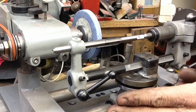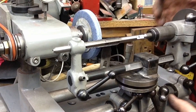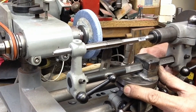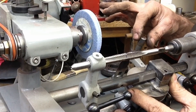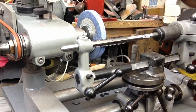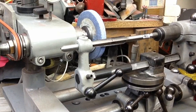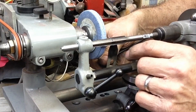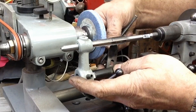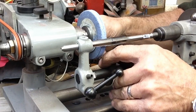To change flutes, you just rotate up to the next one and apply downward pressure to line up the flutes. You can set angles if you want to taper it back, but all we're interested in is some relief. We'll loosen the bottom lever, run it in, and manually feed it across. Then bring it back and feed an adjustment with the micrometer screw. I'm going to move the finger out of the way and spin it to the diameter I want — 0.4987 — and once we hit that dimension, we'll reinstall the finger and put a sharp edge with some back relief on it.